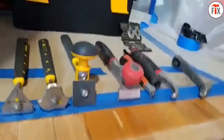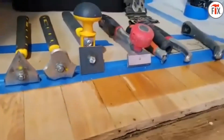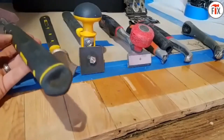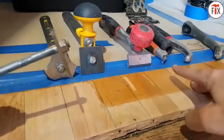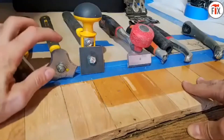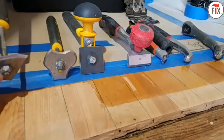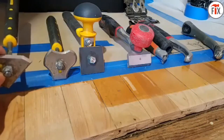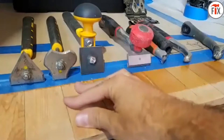These three are usually used with the speed heater. I recommend the Cobra 1100 — not just because they're speed heater scrapers, but they have a really good ergonomic handle, a really thick blade, and these work really well with the speed heaters compared to any of the others. When using the speed heater, I only use the clapboard scraper or the profile scraper for crown molding. These thick-bladed scrapers don't flex at all and cut really aggressively.